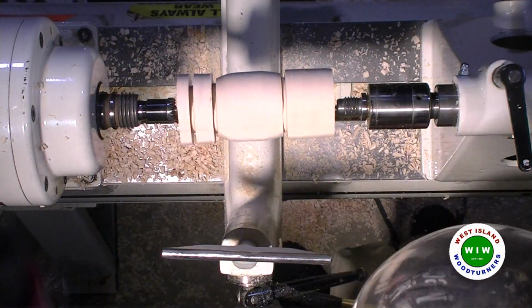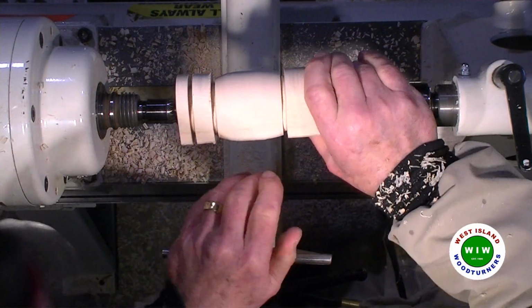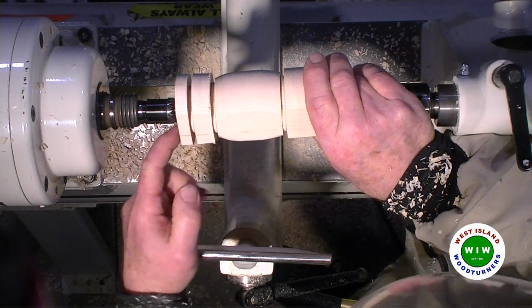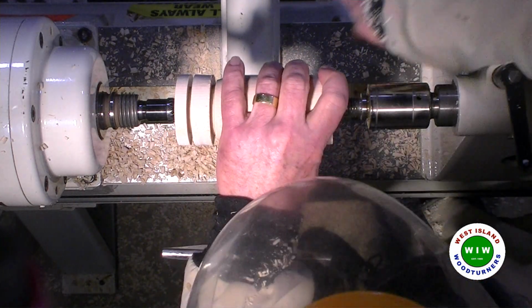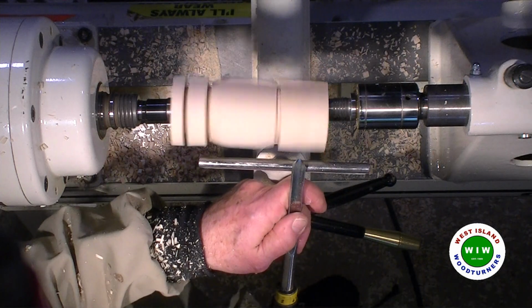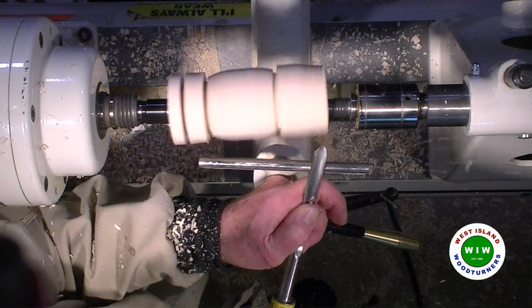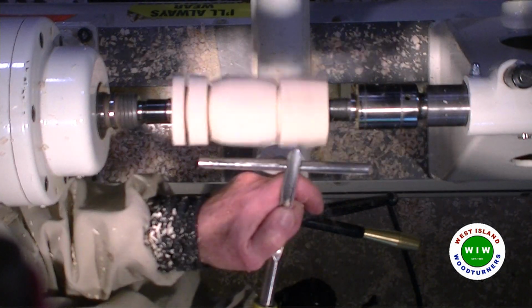I'm going to get one of those steps. Okay, so I leave the step center at this place, on this side. Basically, what Jacques has done now is move the center of the tailstock in a further quarter of an inch. This way he can cut the little nose that he needs, the hedgehog's face.